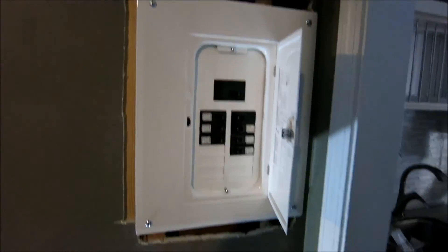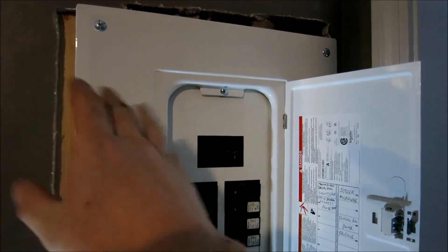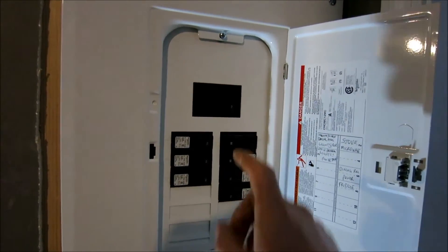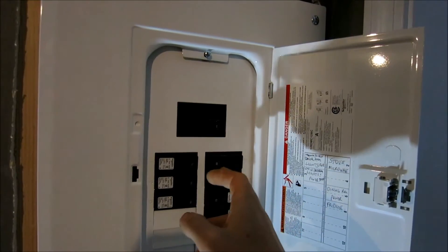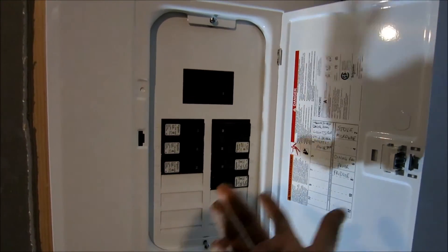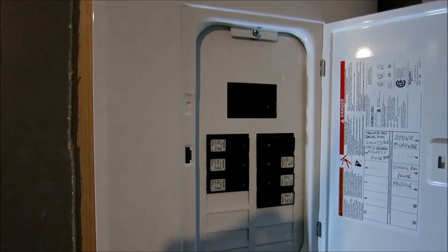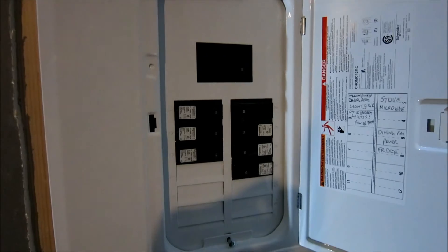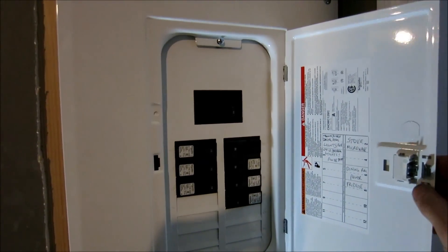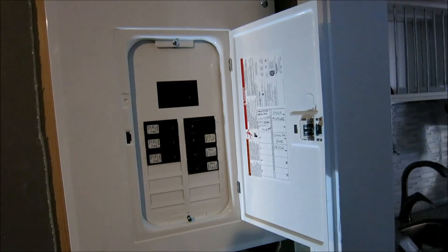Put the panel cover on loosely — I'll do the drywall afterwards. For me I was able to turn on the main breaker myself; you might have to call hydro to switch it on. From there, flick on each breaker one at a time and label them. That's really all there is to putting in a breaker panel. I can't stress it enough — do it yourself if you really want to, but at least get a journeyman or electrician to check it and give you the green light. If you flip it and your house burns down, good luck getting insurance to cover it. Thanks for watching!